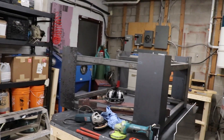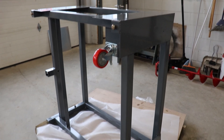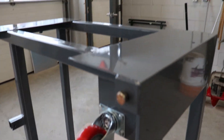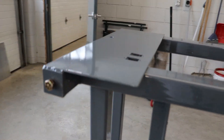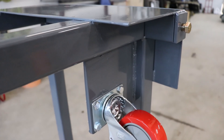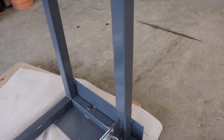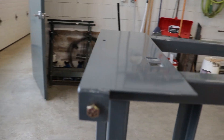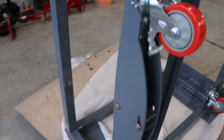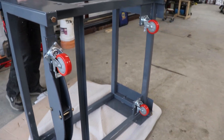When welding is done, we'll send it off for powder coating to match the machine. We built the main structure with 2-inch box tube and welded some 1/8-inch steel plate to the corners to frame in door and access panel locations. The frame intersections have recessed plates for some heavy-duty 4-inch casters, and the ends of the vertical segments of tube are capped and tapped for some 1/2-inch bolts as leveling feet. The rear has an articulating assembly for the caster mount so the heavy machine will roll well on the uneven sections of our floor.